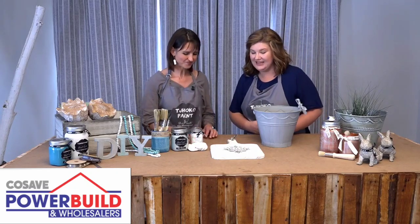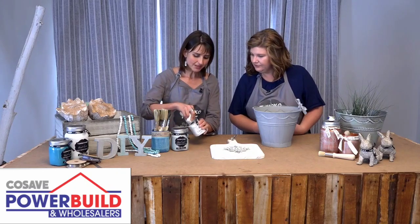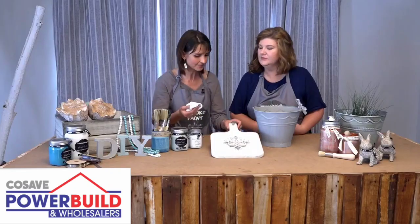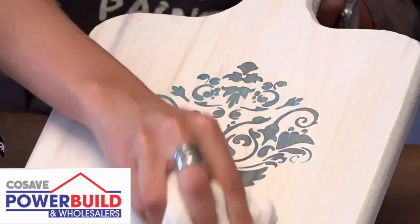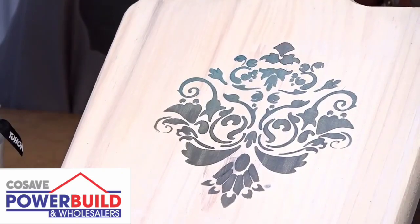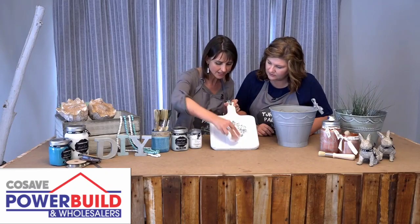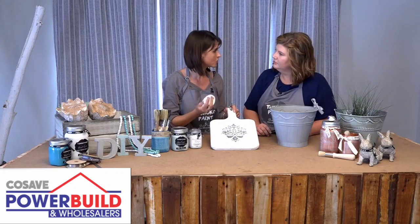Can you show me how to use the glaze? It's quite simple. You need a clean cloth. You need to dip this cloth in your glaze. Obviously when you're doing larger surfaces, we will pour the glaze out into something bigger. You have your dampened cloth and you simply wipe this onto your painted surface, making sure that you cover all the areas. It leaves a very subtle satin finish.